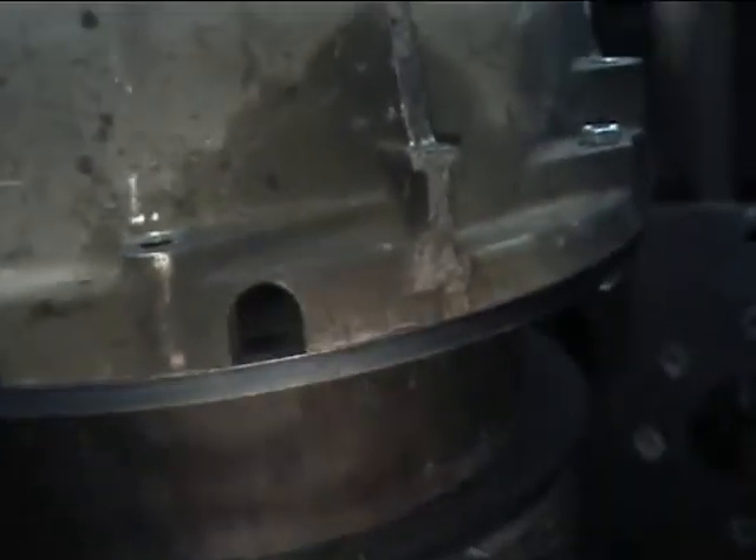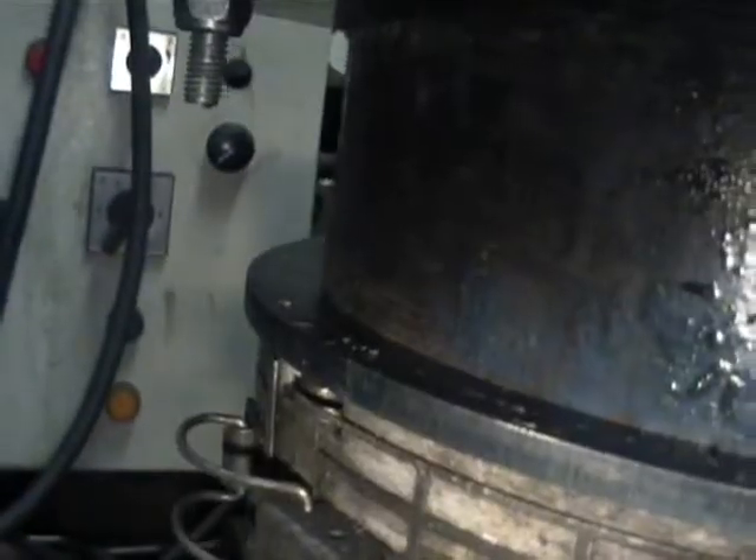The first thing you want to check here is that there's no gaps anywhere around here, because that would indicate that the coupler between the two shafts isn't sitting straight. So just go around and check that out — but you'll see there's no gaps there at all, and everything is sitting as it should be.